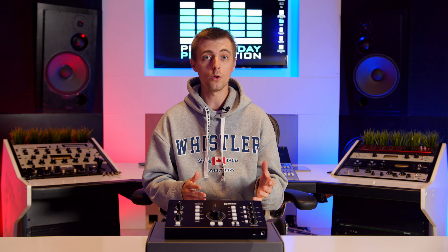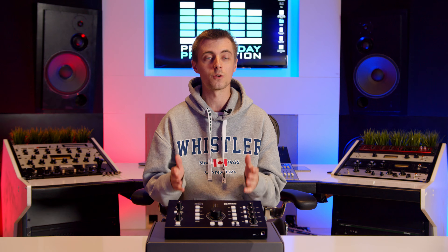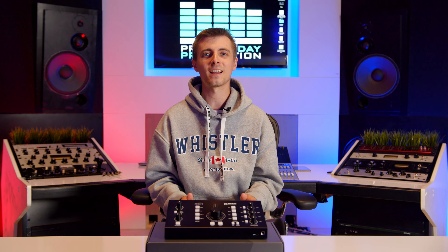The ability to easily switch between different sets of speakers, or select various input sources, or to quickly plug in an external source such as a phone or laptop to reference a track, are just some of the features that can make them a valuable addition to your studio. For the home studio owner, there are two types to consider: passive and active. Passive controllers contain no powered electronics in the audio path, and while these may appeal to the audio purist, they can be prone to external noise and interference, and can't always offer the feature set that active types can.